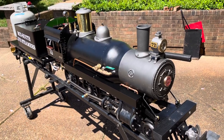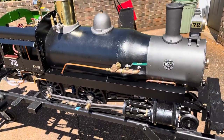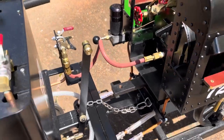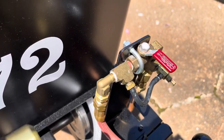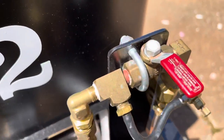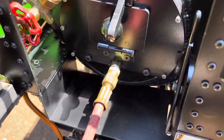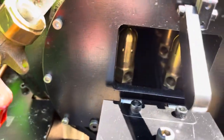I've got pretty much everything assembled now. I'll give you a little side view of what things look like here. This is the connection between the tender and the main engine. This is the gas manifold here. It's got a little needle valve on the outside that allows for a pilot flame and a quarter-turn ball valve for the main flame. I've got CGA connectors and hose, gas fittings that feed the burner, which is inside here.